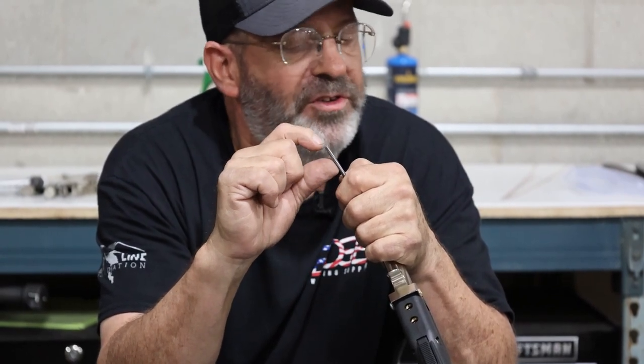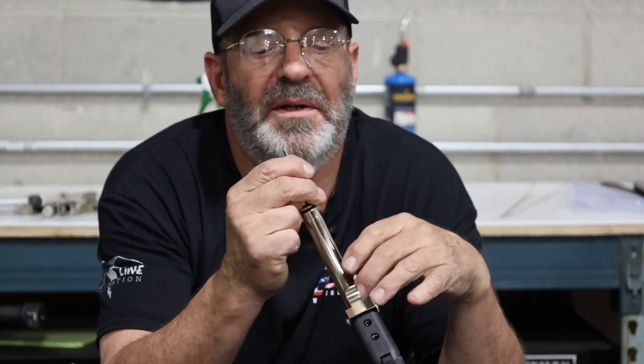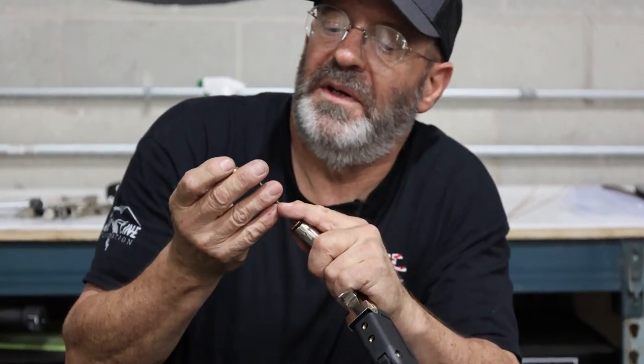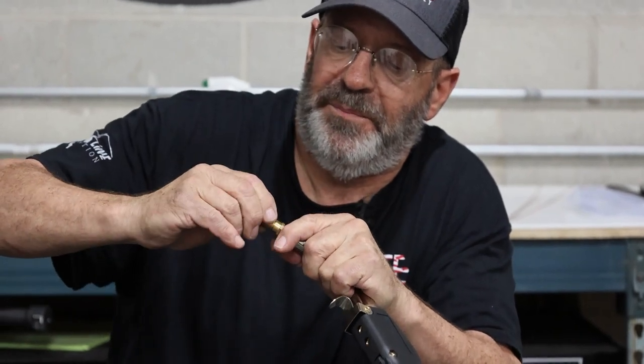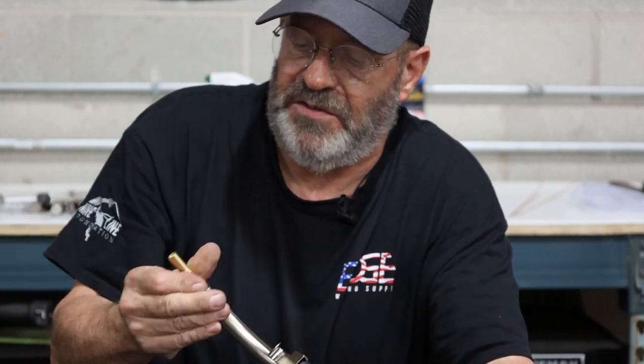When we cut this off, you make sure that you don't have a sharp burr up here that's hooked toward the inside of the liner, because your wire would catch on it as well. So there's a certain way to do these things, certain way to clip them off. I've always taken a file and hit that and kind of pushed away the burr edge. This has got a little one, but not bad. Anyway, we can thread this up in here and push down and basically install the diffuser back in this gun.